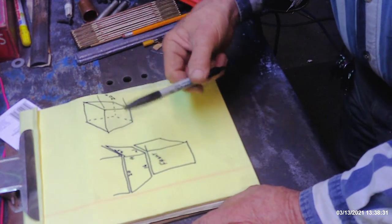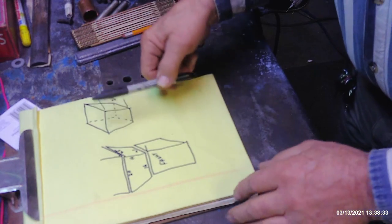That's how you start off with the basics of learning to visualize what it is you want to manufacture or fabricate. So Julian, if you just sit around watching television with a notepad, a pencil, and a ruler, go ahead and practice drawing a few boxes. When you get on the next job and need to measure something, remember how to visualize what you want to build because of the configuration of how the furnace is sitting in relation to the plenum. Draw that configuration out, then figure out how to add those dimensions to it and build on it. You just do one thing, one step at a time — and the more you do it, the more easily it will come to you.